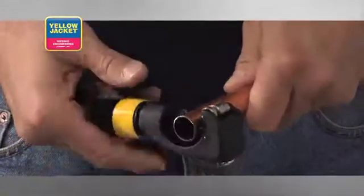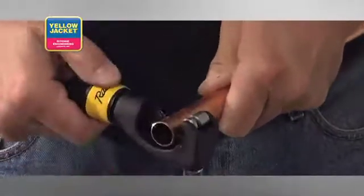Now slowly roll the entire tool and pay close attention to the score left behind by the cutting wheel — this is your cutting line. From here, continue to gently tighten the feed screw every two to three times you roll the tool around the tube. Taking your time will help prevent the cutting wheel from jumping your original score line and compromising your cut.